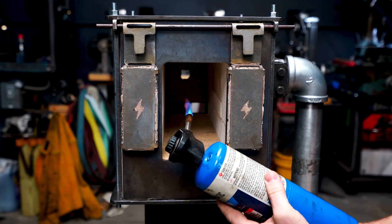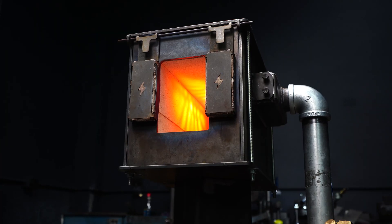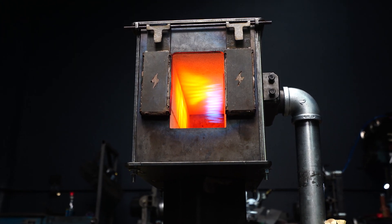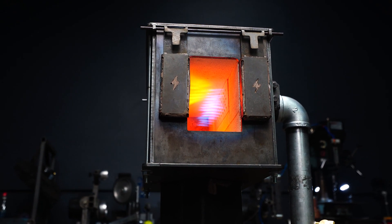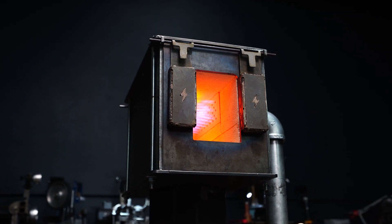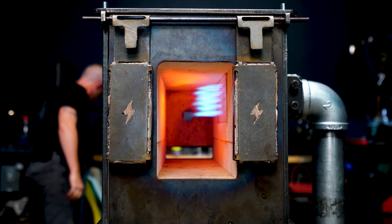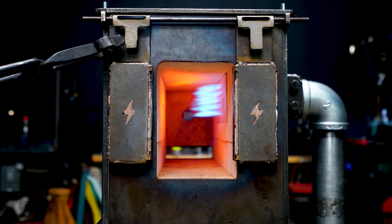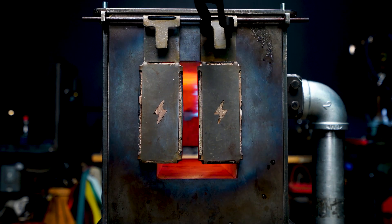We test-fired the Apollo Forge and it was a massive success. The thing burns evenly, it warms up fast — forging temperatures in 10 to 15 minutes. The heat radiation from the device was very minimal. You could set your hand on top of it even after it was running at 2,100 degrees for 20 minutes. Things like that make all of the time, effort, research, and development worth it. You have a theory in your head and you hope it works — and then when you actually put it into play and you see it happening, man, it gives me goosebumps. I love my work so much.